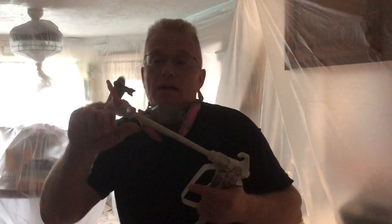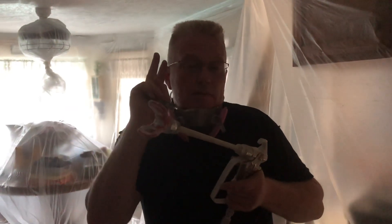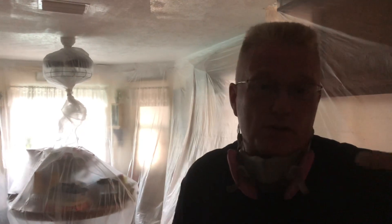These are a couple of tips on painting a ceiling with an airless sprayer. This is a 211 tip, which gives me a four-inch fan. The tip that starts with the number two gives you four inches of fan — not a lot, but we're indoors and we don't want a tornado of silica dust going all over the place, so we used a small fan. It takes a little more time, but it has a lot more control over the amount of paint that comes out of the sprayer. I have my pressure on the sprayer reduced to about half, and so it gives me a nice even layer of paint on the whole ceiling.